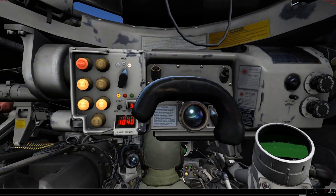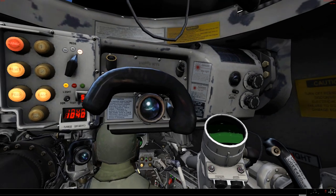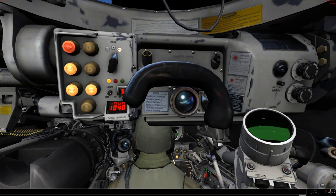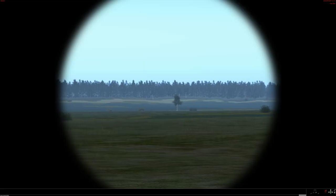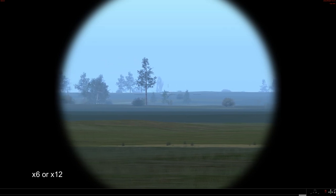This device up here is all about the laser rangefinder, which of course is in the right blister with its own little ballistic shield. So you boresight the laser separately. There is a little counter here that says how many pulses have happened since the laser was last refitted — there is apparently a service life on them. The actual sight itself looks very similar to what you would find in a regular reticle. Find your target, you can zoom in. And when you laze, you are going to get three returns.